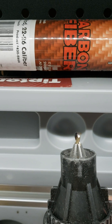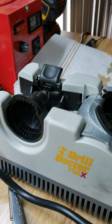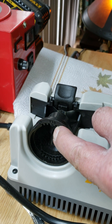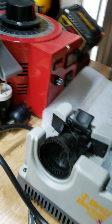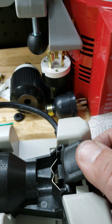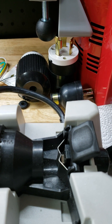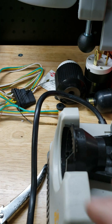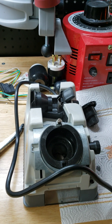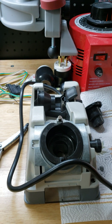Doesn't get better than that. This is a great machine once you get it properly set up, and hopefully this video informed you on how to do the 135-degree angle — this is the only video you're going to find on that. The key is this notch right here: put it just to the right of the 118, make sure your stop is set up properly, open and close the chuck, turn the drill from the back to make sure the jaws are tight, tighten your chuck, put it in and turn. Vermont Prepper out — please like, comment, or subscribe. This was a big accomplishment for me and hopefully it'll work for you too. Take care!